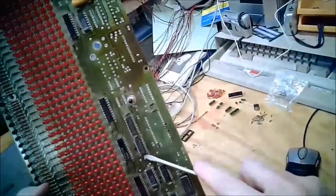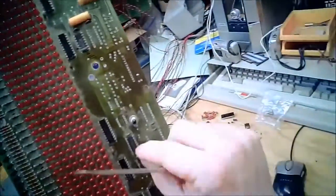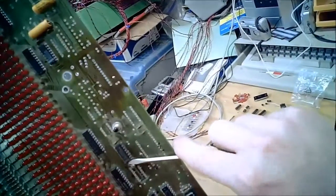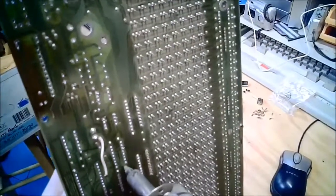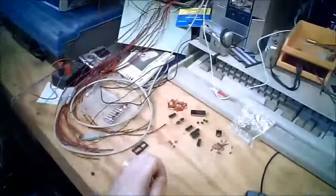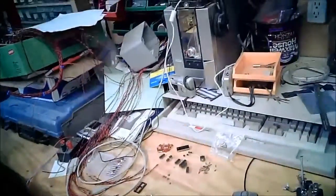Okay, let's see if I can pop these chips out. There that one goes. So there is a standard, well, semi-standard configurable up counter. And here is a slightly not quite unsoldered, but now it is, up down counter. I have used the up-down counters in projects before, and they're kind of useful. The preload portion of it is an interesting feature if you wanted to have a timer of some sort where you could set your time limit and then hit the start button. Up down is good for just general counting.